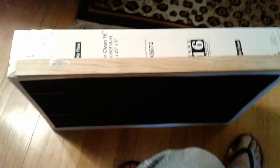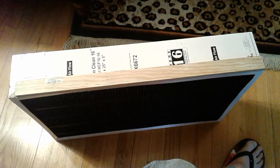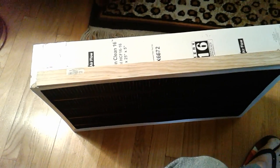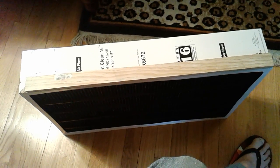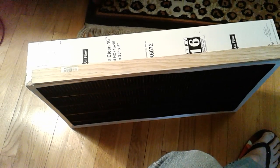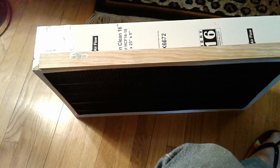Every installation is going to be different depending on the manufacturer of your furnace box, so look carefully — you might need thicker or thinner wood. Check with the manufacturer to make sure this modification is acceptable. You don't want tape or any materials going into the furnace and hitting the heat exchanger, as that'll smell things up pretty bad.